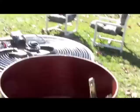This is a black drum. A lot of people want to know: can you just put this drum out in the sun and collect sunlight? You can, but my experience with this is that the surface area of the drum is not very good, and you also end up having to depend entirely on the thermal heat transfer of water. So you end up with cold spots on the bottom and the backside where the sun isn't. It eventually mixes, but it's pretty inefficient. The sun's directly overhead — a barrel like this, you're only getting the top part of the sun.